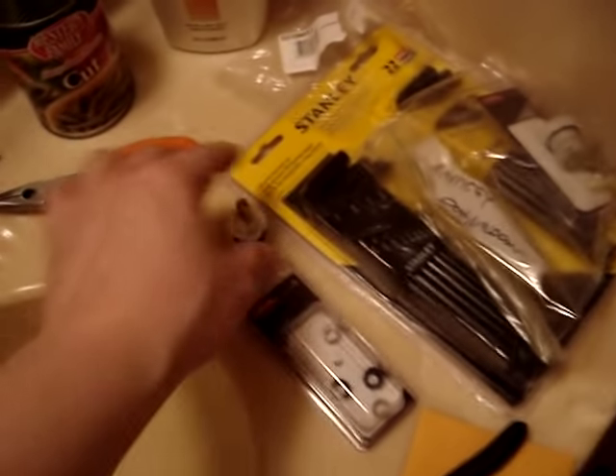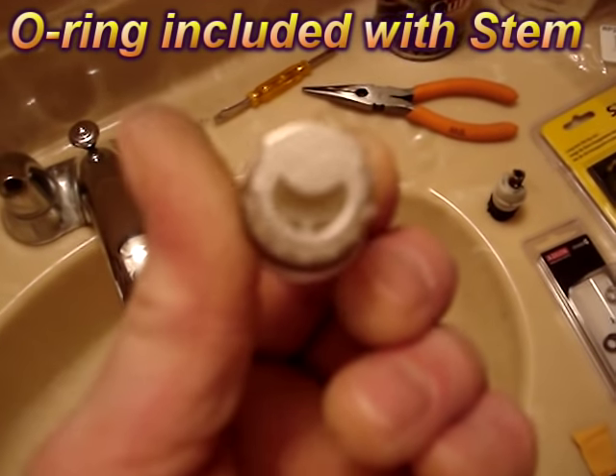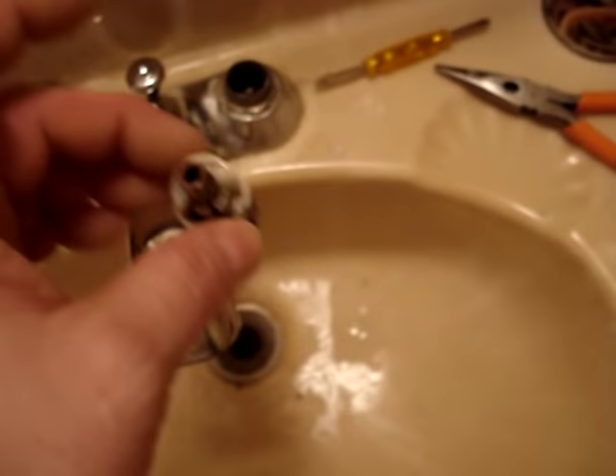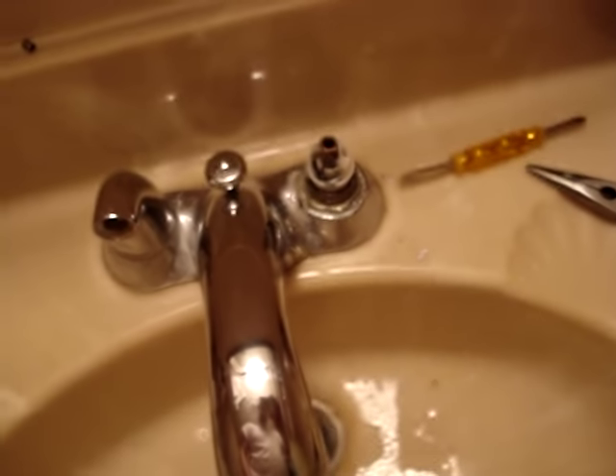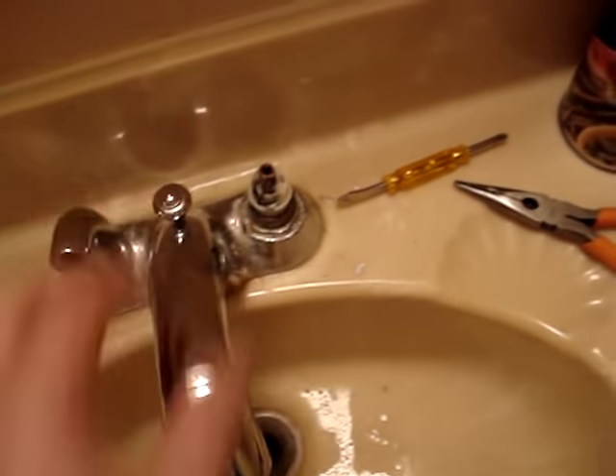You don't need all the other parts I got — the washer comes with the valve stem. You can see they look the same; it's got that half moon shape on the bottom. Since mine was so hard to get out, I did not pay attention to what orientation the valve stem was sitting, and that's very important. The only other video that helped at all was a YouTube video by a guy named Jeff Patterson — I'll include the link. He does this same model and shows you pretty well how to replace the handle. The only thing he doesn't go into is what if you live in an area with extremely hard water. Definitely check out his video.